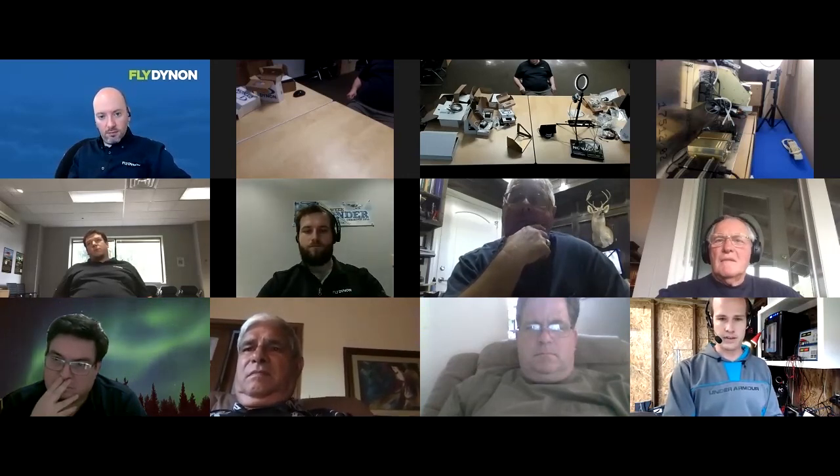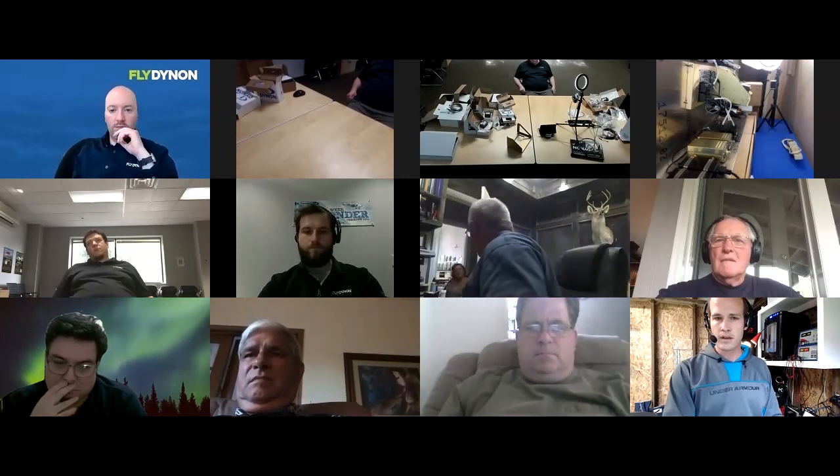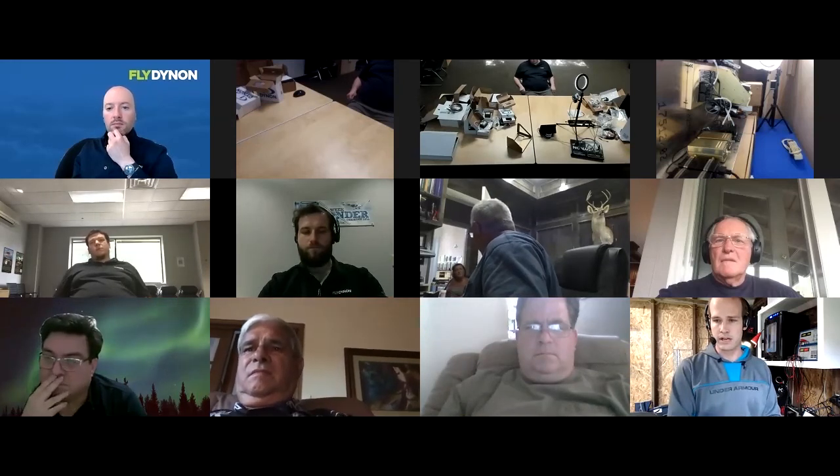Other than that, everything else, Mike. What about the requirement to name the volume AFS data? That is another thing on older software. Version 16, we've rectified that to make it a little more simplified, but you do want to have it all capitals, AFS_data, as the volume name. Are you getting sectionals or?